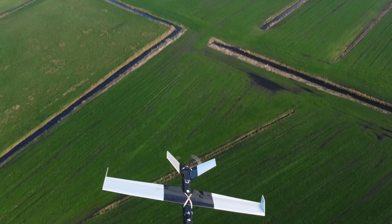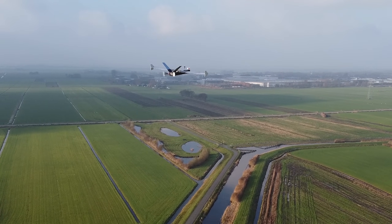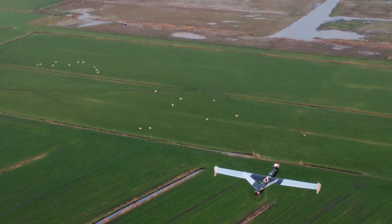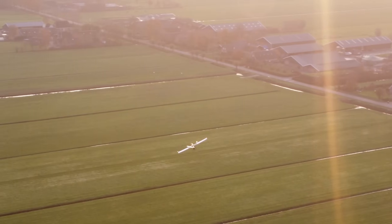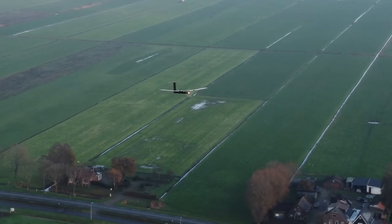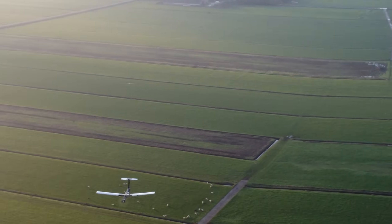This particular design is the outcome from my development of building capable FPV planes using Experimental Airlines building techniques. What's different in this design compared to its predecessors is that it has a Depron wing which is made wider and thicker, but approximately 200 grams lighter than all the slimmer wings I've built from regular foam board, which is about 450 grams on average. The Depron wing idea has been around for quite some time and I applied it to another design of mine — an FPV tractor with a T-tail — and got over 1 hour of flying time per charge. So the Depron wing construction is going to be the future for my builds.